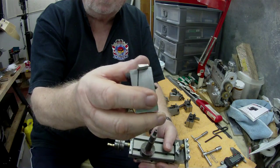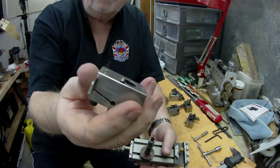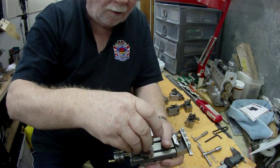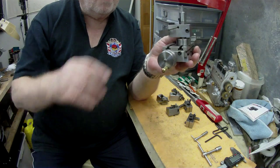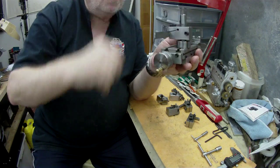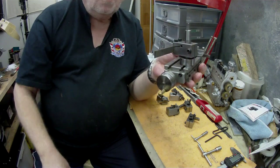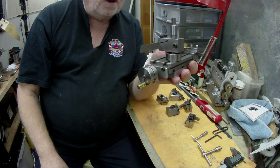It's a cap screw, and I just machined a 45 degree — or maybe a bit less than that — on the tip. That drops down and locates in the serrations. I believe each serration will give you seven and a half degrees as you move around. Although when you look down at the tool, it's very easy to locate the serration that you were in previously when you were changing over. There really is no difficulty in it at all.